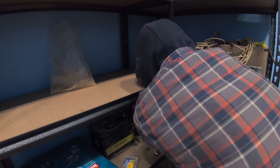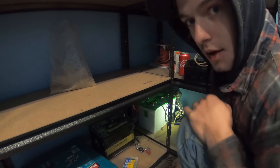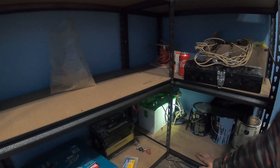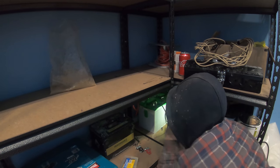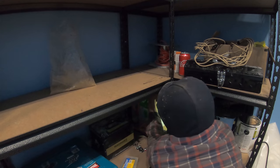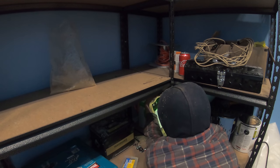What the heck — I have a tendency to assume the worst when something doesn't turn on. It was just a 20-amp fuse — blew it. I must have tapped some wires when pulling things apart. I already started disassembling the charge controller — it's always a simple thing. Quick and easy fix: I've got my panels coming in, the lights and battery with a fuse on the battery. Clean and neat.